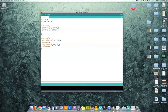In the previous code, we already have the delays set up for the right times. Now we just need to add in the new LED light. Underneath the digital write for the red LED, we'll add a new digital write with yellow, low in the parentheses. Then after the delay, write the opposite. Underneath the red, low, put yellow, high in parentheses. Make sure there are no errors in your code, and you've got semicolons after each line of code inside and outside of the brackets, and you're ready to upload.